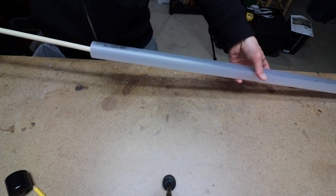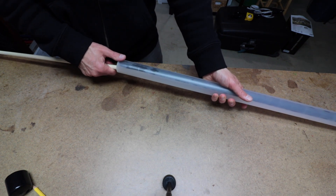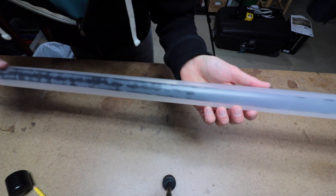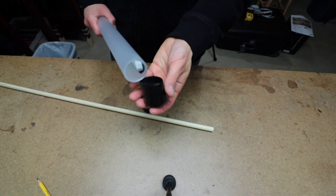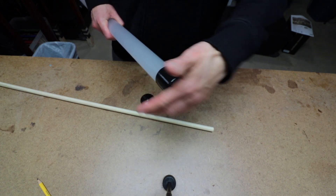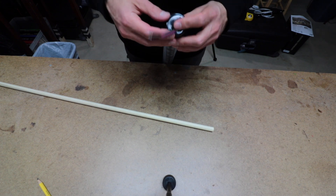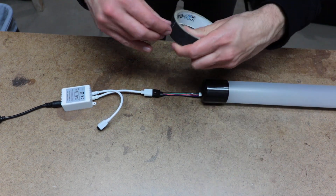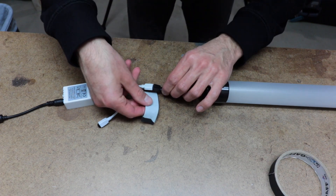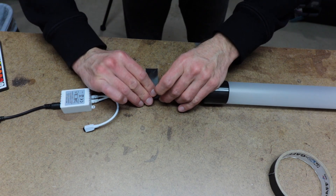It takes a little bit of effort because you lose a lot of leverage as you get towards the middle, but I found it easiest to turn it upside down and press it up. You can see which part of the tape is stuck and which isn't — the dark spots are stuck and the lighter spots are not. You don't have to get it perfect, but get it as good as you can. Put your caps on, plug in your LED light strip to the controller and infrared sensor. This plug does not stay secure on its own, so you're gonna have to secure it with some tape — I just use gaffer's tape, you could use duct tape, whatever works for you.